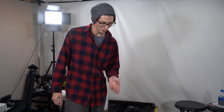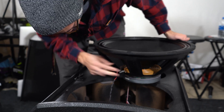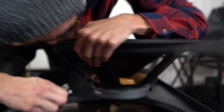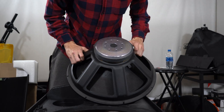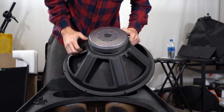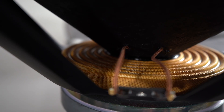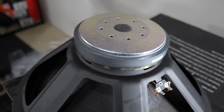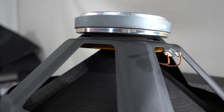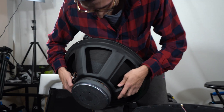We're definitely returning this thing — we got two minutes in and already smelled voice coils. Let's look at the driver. It feels light coming out. At least it has spade connectors, and it does have some venting on the basket though it's still warm. No double spider like the KSW 181s, pretty mediocre spider material at that. The magnet is kind of small — this driver honestly weighs maybe 10 to 12 pounds, not very heavy at all.